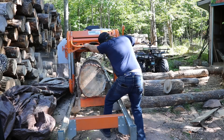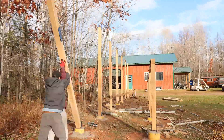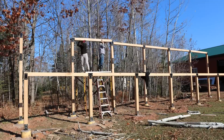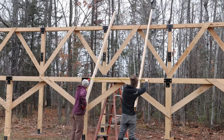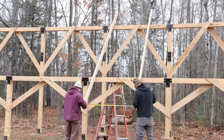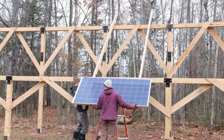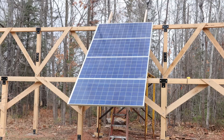We milled five-by-five oak logs and then began erecting posts from those footings, putting beams together, and eventually made rafters by joining two one-by-five oak boards together with screws and a little industrial glue to create a nice rafter system. Then it's just a matter of putting the panels up one by one and wiring that in, putting the conduit down underground, and getting that into the shop over to where the batteries are.